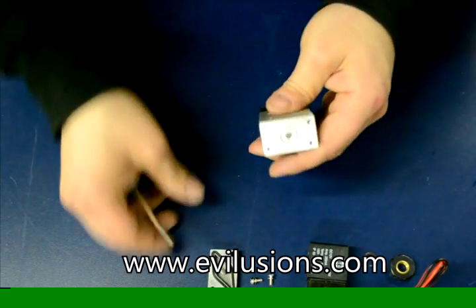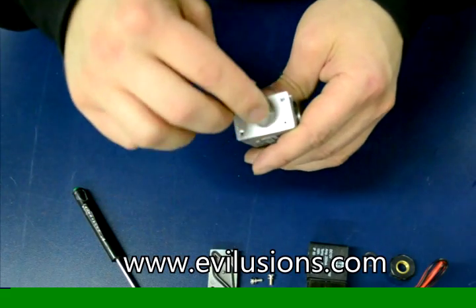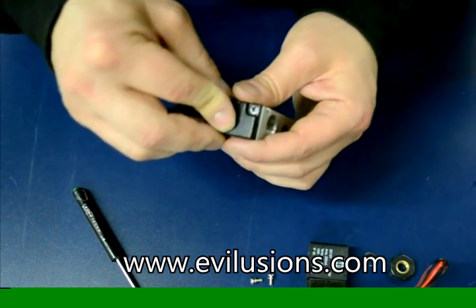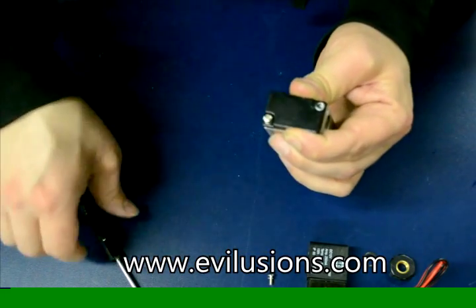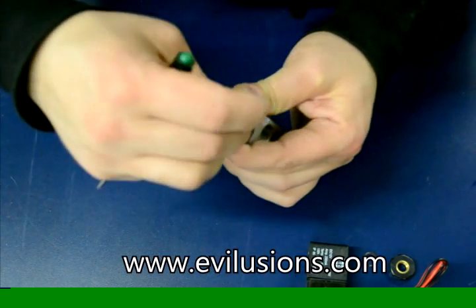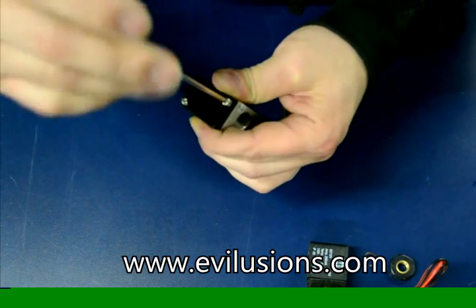Go ahead and re-tighten the screws on the coil end. Put the spring in the counterbore end of the spool — also called the piston; there are lots of names for it. Make sure you didn't lose the O-ring in the end cap, otherwise your valve will just leak out the end. Re-tighten your screws, being careful not to strip them.